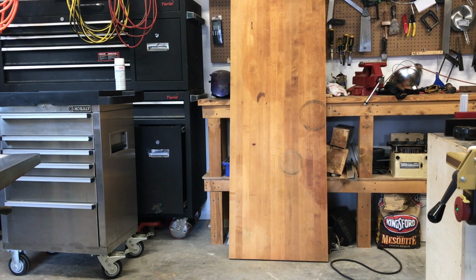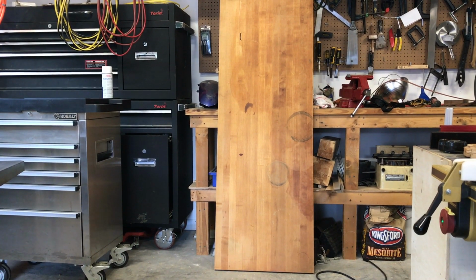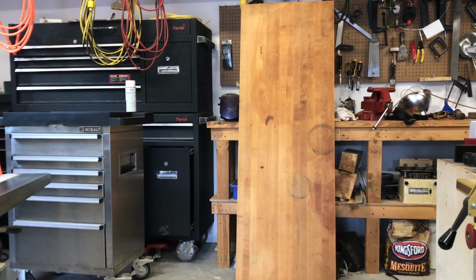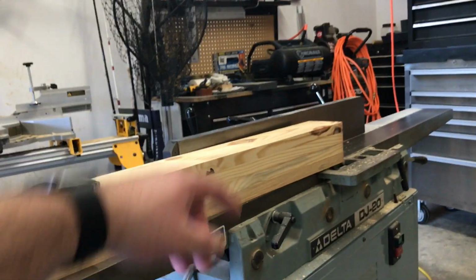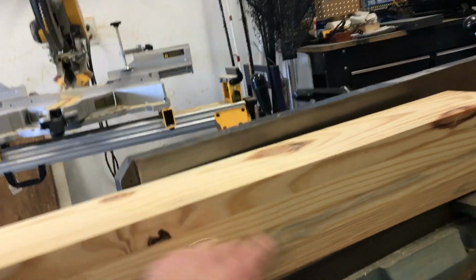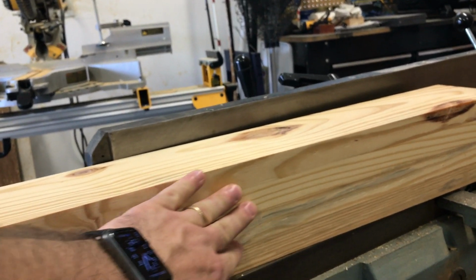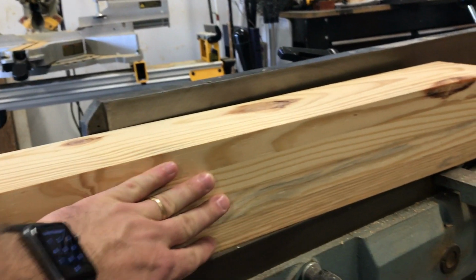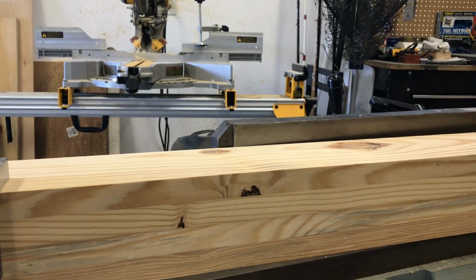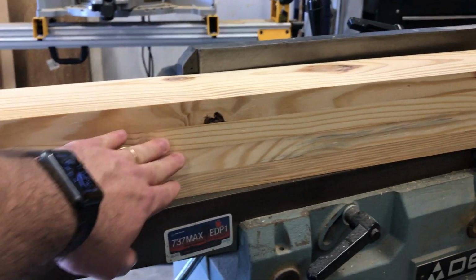But honestly, when you're making your own stuff, sometimes the natural character of the wood brings out interesting qualities in furniture. So for a little feature like this, what I'm going to do is get a torch and torch this. All these bond lines, see how the grain's a little different? All this will disappear when I torch it, and then I have some polyurethane with a chestnut stain, and that will just bring out sort of a blackened caramel.